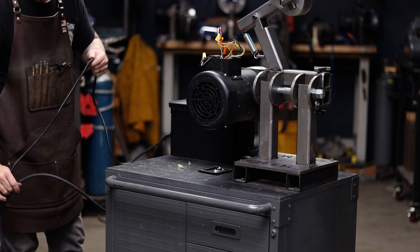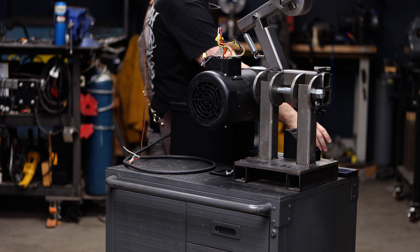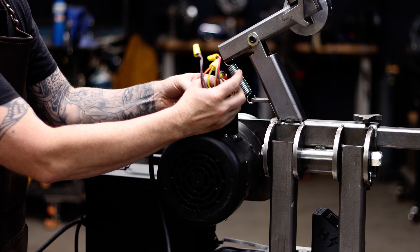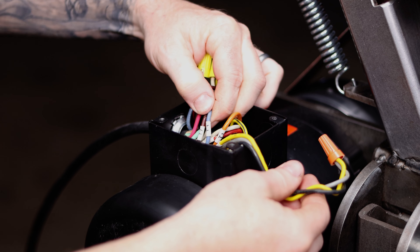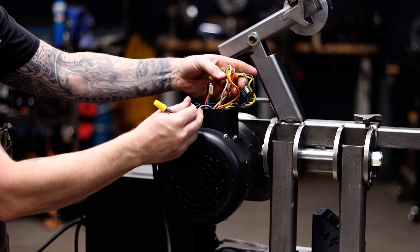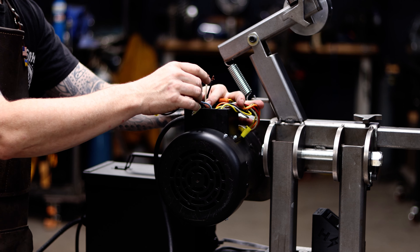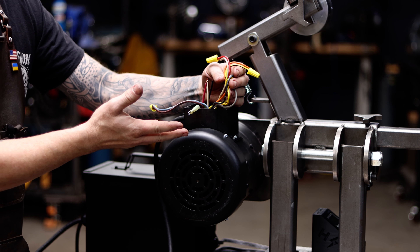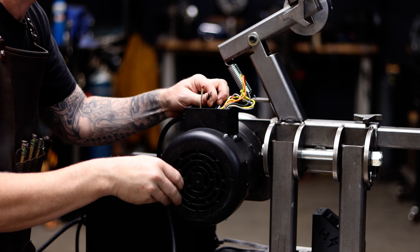The last step before we can actually test this is to route the wiring up into the motor. A few people have mentioned I don't reference these wires by color — that's because you don't wire a three-phase motor with color; you do it with T-numbers. There are little T-number labels down inside the motor, and on that wiring diagram it will become very clear how it all goes together. You've got a ground and three wires coming from the VFD. The motors all use different color wiring, so manufacturers got around this by using T-numbers — you just match the T-numbers up with the proper color against the wiring diagram, and that'll get you where you need to go.